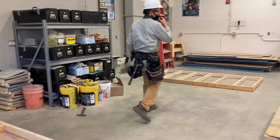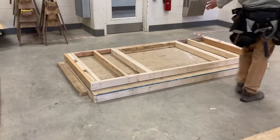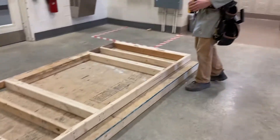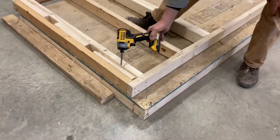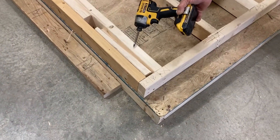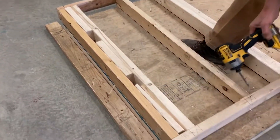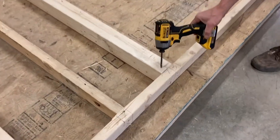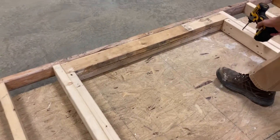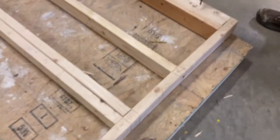We walk over to this group — they've got their wall finished and they're getting ready to square it and put their plywood on. Looking at our marks, we have our XPX here — that's our outside corner. We have a full height 43 and a half inch stud and three blocks for the outside corner. Then a common stud, our king stud, our jack stud, our header coming across to the jack, another king stud, a common stud, and another outside corner.